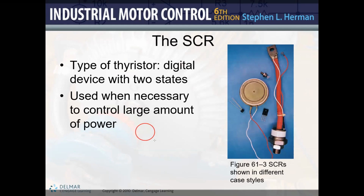Okay, like that circle that you see that I draw at the bottom, let's say that that is a conductor. Because of frequency in an AC circuit, your electrons are going to travel around this area here, on the outer surface of the conductor. So all the other area in an AC circuit, the center core of your wire, is not being used by your current, by your electrons. Why? Because that's one of the effects of transmitting power with AC.